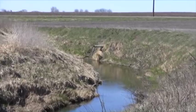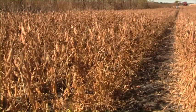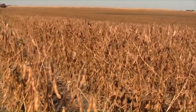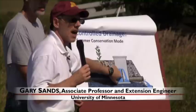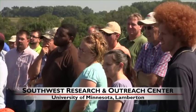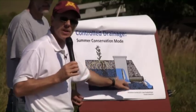My dad said that we need to be able to shut off the drainage, because in this area we get into August and it can get very dry. What if we were able to maintain more soil water in the profile at those times? This is kind of in the summer conservation mode. This structure has a set of baffles — stop logs, boards, weir boards in the middle — that you can raise and lower, so you can cause that water table to be even shallower before it leaves the field, or you can take them all out and put it in traditional drainage mode.